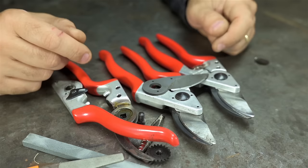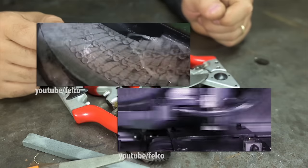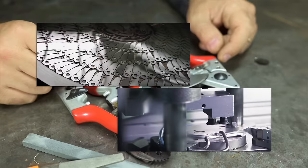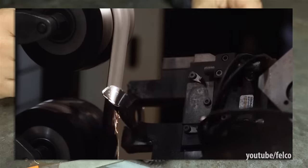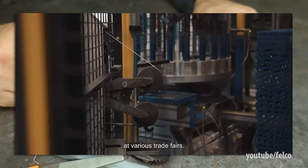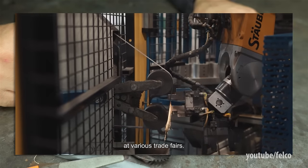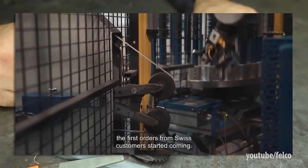Of course, old Ben was right, and I found some videos from Felco. Unfortunately, their quick montage-type videos don't exactly show the entire process start to finish, but I did find two things. First, it appears they grind the bevels with a robot. Here it's shown doing the back bevel, but it's probably safe to assume it does the primary bevel too. It looks like the robot is doing the 5-degree back bevel on the bottom, and I bet it does the primary bevel on the top of that grinder belt.